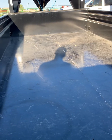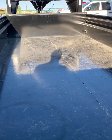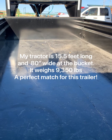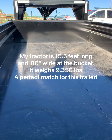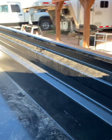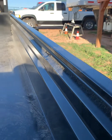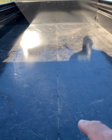I have a little bit of a complaint about the gate having difficulty latching. I do understand it's brand new, but right now in order to get that thing down you've got to tap it with a hammer to get that gate to lock. Inside, a very, very roomy box. The reason I bought the 16-foot — I didn't need that capacity for hauling. You're not going to fill this thing up for gravel and actually be able to pull it around. With it rated at 15,680 pounds and the trailer weighing about 5,000 pounds, you'd have about a 10,500-pound payload — that'd be five and a quarter tons. The bed has a 24-inch side in 10-gauge steel with corrugation to give it more vertical stiffness. The top rail is two and a quarter inches with a single seam on the floor, supported by that beautiful box substructure underneath.